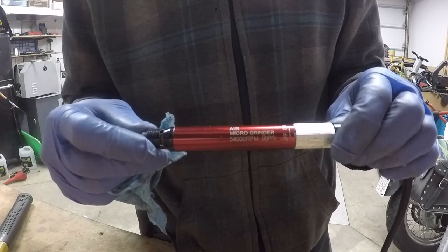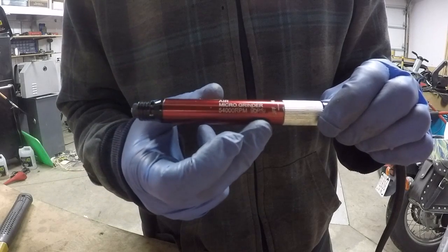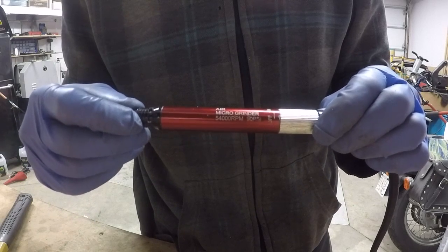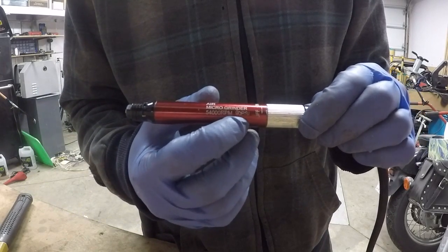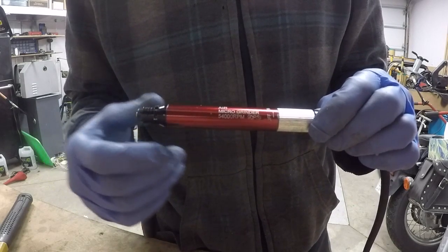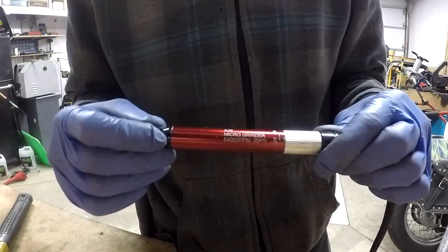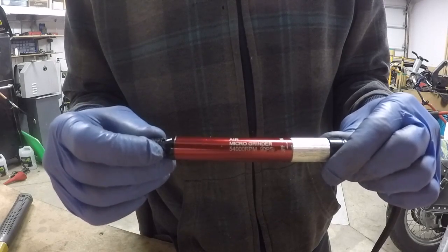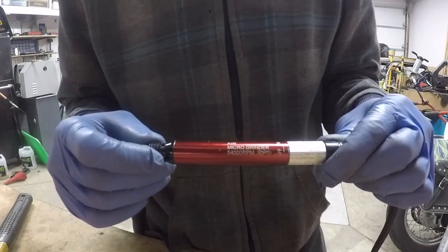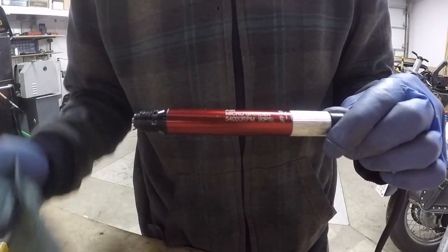If you have a little oil-less air compressor, it's not going to run this. 90 psi is very deceptive. A lot of people are probably thinking, well, my air compressor goes to 120 psi. Well, this 90 psi rating is at about 9 cubic feet per minute. So it takes a fairly serious air compressor to be able to produce enough airflow for one of these things. Despite being tiny in size, they consume a large amount of air, and that is partly due to the fact that they aren't terribly efficient, but it's also just because they turn at 50,000 RPM and they eat up a lot of air.